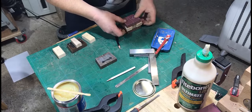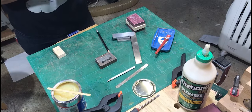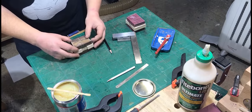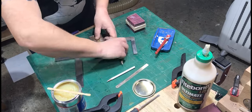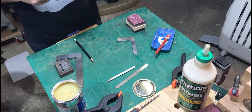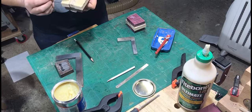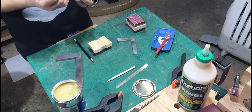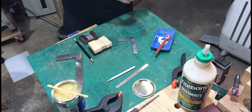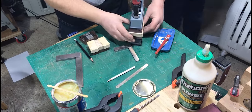As I mentioned earlier, I had cut the outer cheeks to really close to the exact size to avoid going into the resin at a later time. This did mean, however, when it came to gluing up I had to be incredibly precise that both cheeks were aligned. I drew lines as reference points and used engineer squares to aid glue-up to make sure everything was flush, which meant minimal clean-up once the glue had cured.